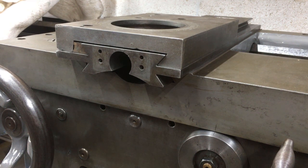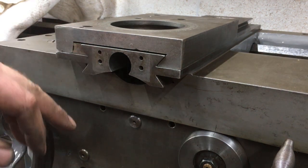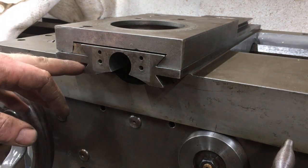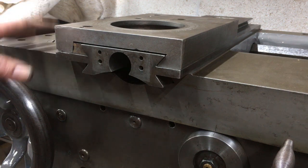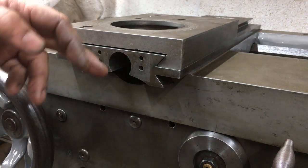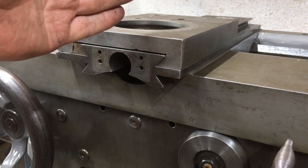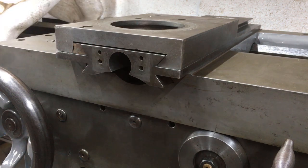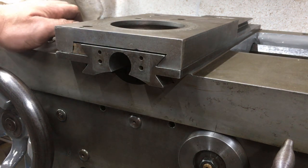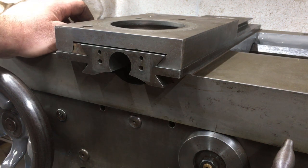So I'll just get my mind around the reassembly of the cross slide, the dovetail slide and the cross slide. With respect to the gibs, I had in an earlier video already built this up and checked that the direction of cross slide travel was within the tolerance, so it actually turns slightly concave by something like half a thou. I can't recall offhand. It doesn't matter at this stage.